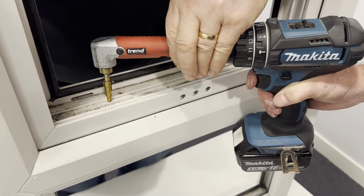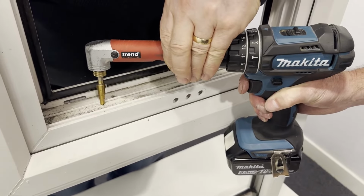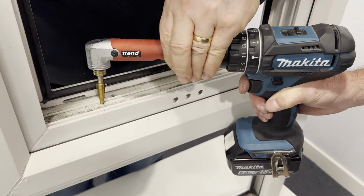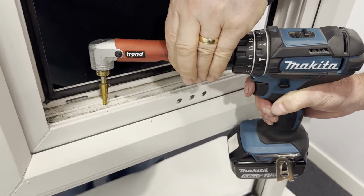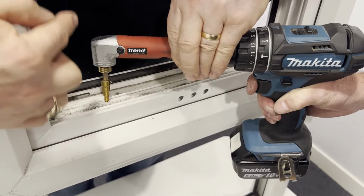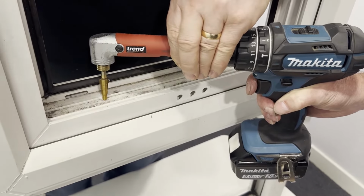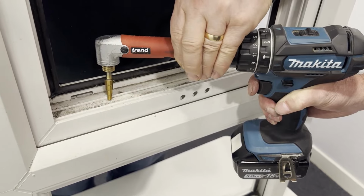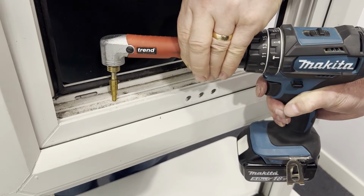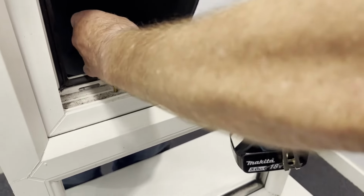In these circumstances, we've discovered that it's usually better to use what's called a stepped cone bit, which allows you to regulate the size of the hole dependent on how far through you're able to take this bit. And that's again because the 10mm bit is usually quite long. So we'll drill this now and transfer to you, Lorraine.